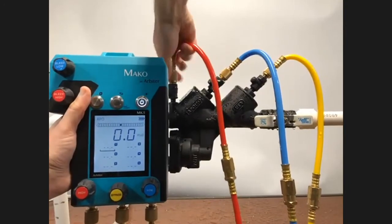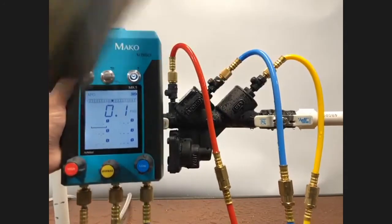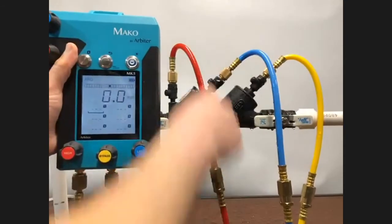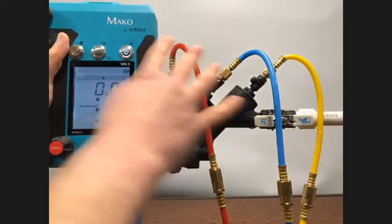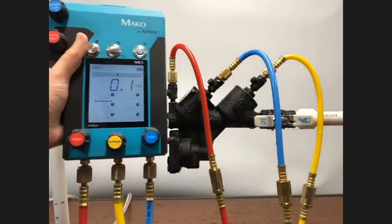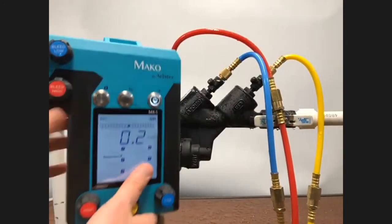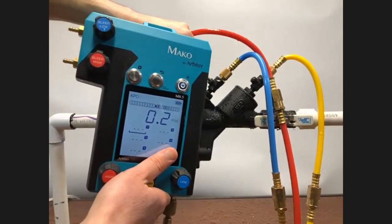And one thing I'd like to point out while I'm getting that nice and snug: the hose filter housing, we generally tend to recommend you connect that closer to the source of water. The important thing, though, is that you're always consistently hooking up your hoses so that debris doesn't pass into the gauge. All right, now that that's all connected, let's go ahead with our test. So the first step I need to do is to get my screwdriver and open up test cock number 3.